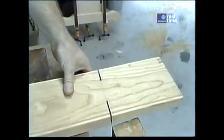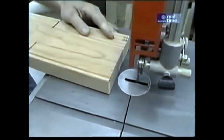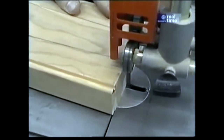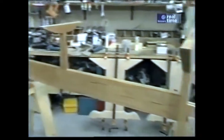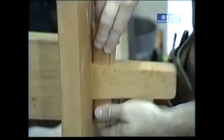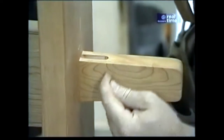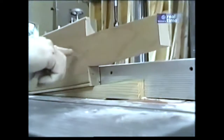On the end of the stretcher piece, you can see by the layout lines that it goes straight for a ways — that's where the trestle fits on — and then it's slightly tapered. It's a heavy piece, so it'll take some careful hand-eye coordination to get it through the saw. The trestle assembly is held together by wedges on either end: straight on one side and tapered on the other so it'll wedge in tightly. That means I have to cut the mortise at a five-degree taper over on the drill press using a piece of wood cut at a five-degree angle.